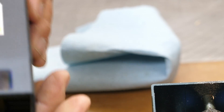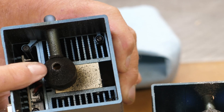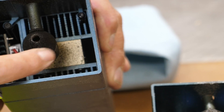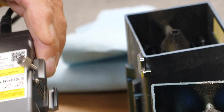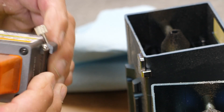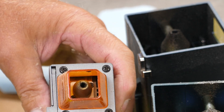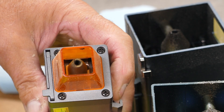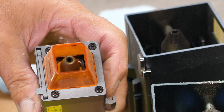This is a 30 watt. Even though the hole is bigger, there is a whole lot of buildup around it, and you need to clean that off from time to time. And this one here is an xTool — a 10 watt off of an xTool laser. You can see where that buildup is starting to get up inside where you really don't want it, because it will start to affect your beam.